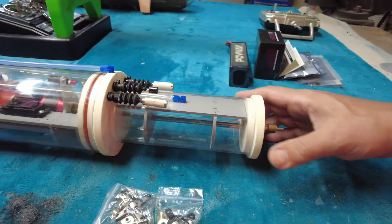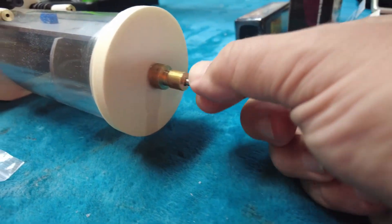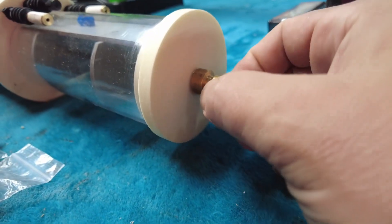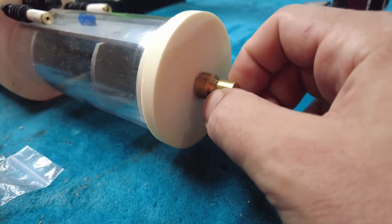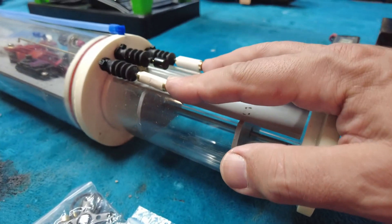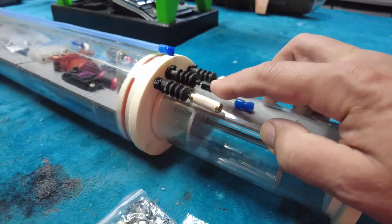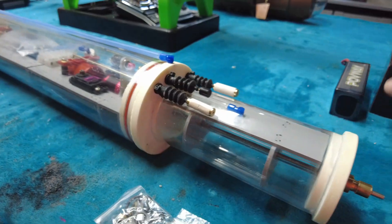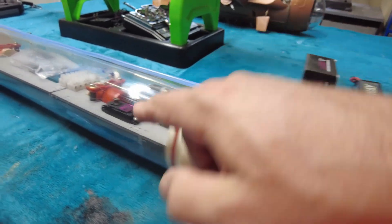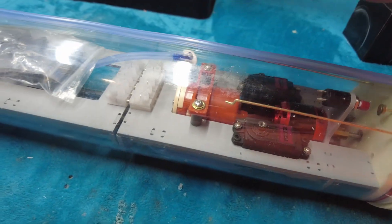Going back to front, we have our main drive seal here, and you'll notice this is loose — that's pretty typical, so we need to address that. Our two linkage outputs in the back, power switch which we're going to be doing away with. We're going to install a remote on-off switch. Then servos — full-size servos — and your rear ballast pump. There's the snorkel intake right there.